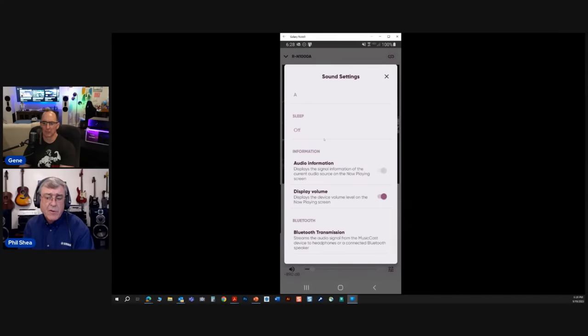In AV receivers, there are so many configurations because you have bass management, audio delay, and all that stuff. So when you start adding more features, you start to lose resolution. You could no longer maintain that 96 or 192K resolution. But with the two-channel stuff right here, it's wide open because it's barely sweating to do any of the processing.